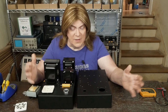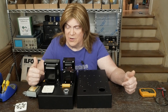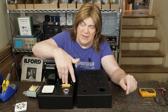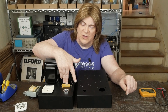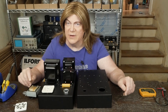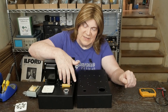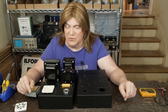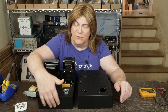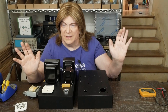Those aluminum spacers are supposed to be here tomorrow along with the power supply 50 ohm resistors, and I'll make the call on how I'm going to mount those. This one's going to bolt down and I'm going to put some really nice computer CPU heatsink compound between this and the chassis so it can dissipate the heat across the chassis as well as in free air. This is a 50 watt resistor, so it's got plenty of reserve. I'm still not sure whether I'm going to put a voltage display on the front or just leave it blank with some badges.